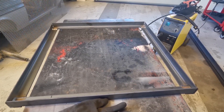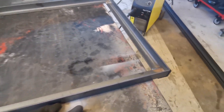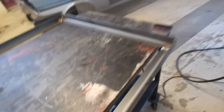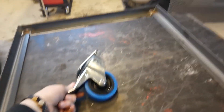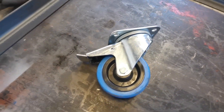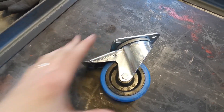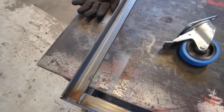Okay, that's the bottom half of the frame done. In these corners here I'll be welding the wheels. I've got these wheels for it — they are 70mm and they are 125mm high. So those I'll be bolting into the corners underneath so it'll be rollable.